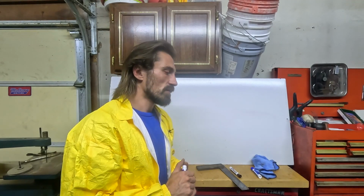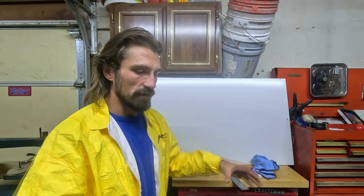I much prefer it. I think it makes a sturdier product. When you walk, there's not as much bounce. And it also gives you the freedom for your handrail posts to go wherever and block around them, because you don't have any post actually coming into your joist bays. Everything is below the joist bays, and your joists are sitting directly on top of that beam.